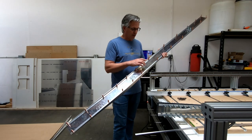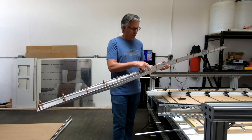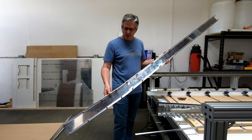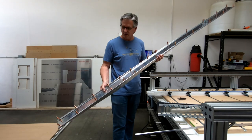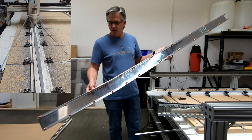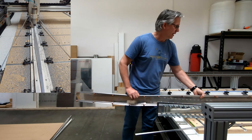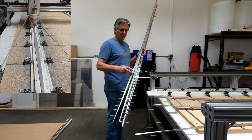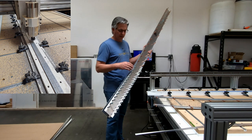What I've done is cut out the spar webs — the center section of the wing spar — on my CNC machine. I pre-drilled all of the holes for the web stiffeners that the wing ribs will attach to. The spar caps, which are the angles on either side of the web material, were also cut and pre-drilled on my CNC machine. This is the right wing spar, and the left wing spar is slightly different — it has a forked part where the right wing spar fits inside the left wing spar inside the airplane.